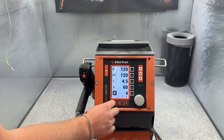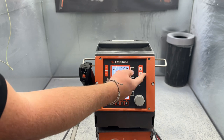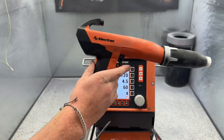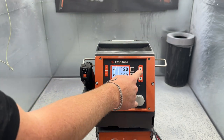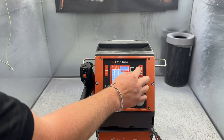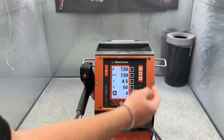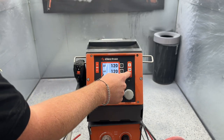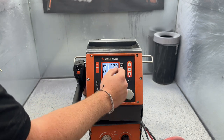Up top here, we have our fluidization and vibrating table control — this is either on or off. If you turn it on in multi-color mode, it's going to be based on the trigger: when you pull the trigger it'll turn on and shut off after 20 seconds. Or if you're in hopper mode, you can hold this down and change this to hopper — now it's either on or off based on pushing this button. You can also turn on the Bluetooth using this button there. All of these settings are completely customizable by hitting the button next to them and using the dial to change them.